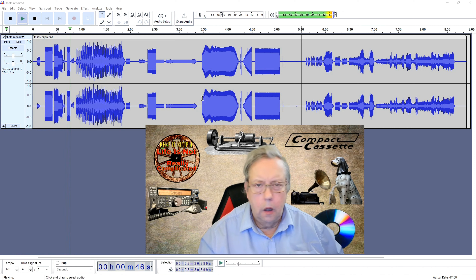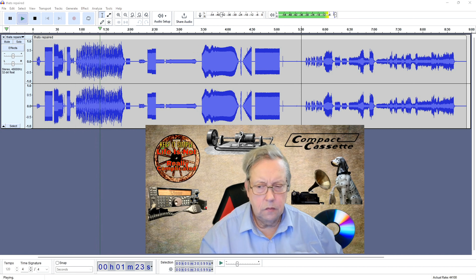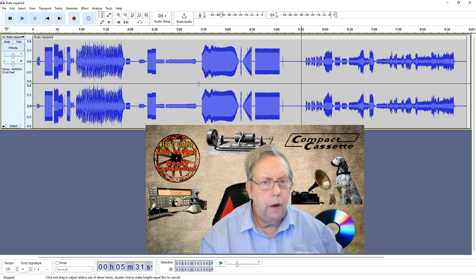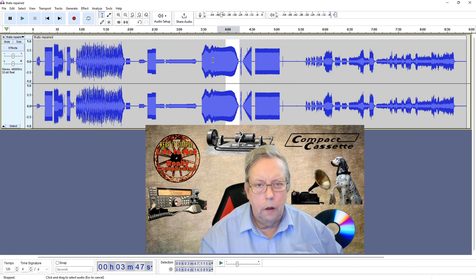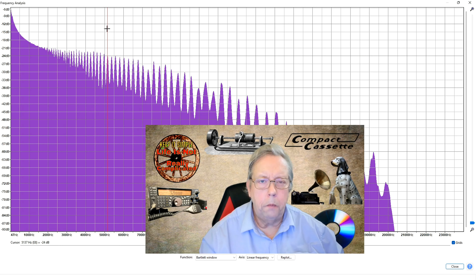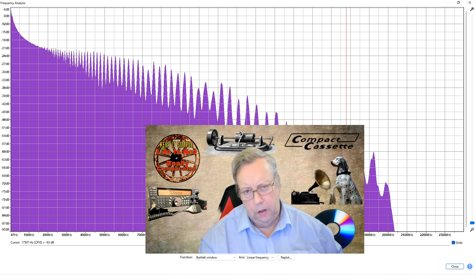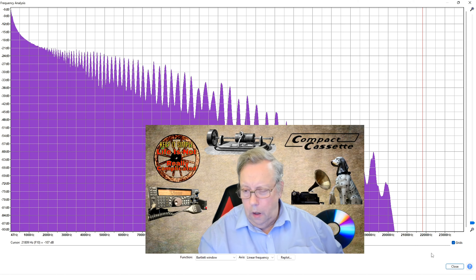Notice the lack of wow on there. Sounds pretty good to me. Then we get on to some of the other bits - there's your minus 20. What I then normally do is show you the results, so let's have a look. This is the frequency response for this tape. Just plot the spectrum - boom - there it is. It's got output up to 20 kilohertz at 0dB. There's a bit of variation but you can see this is a very good output.